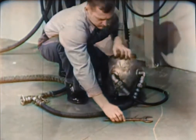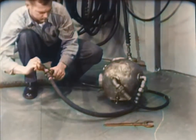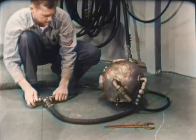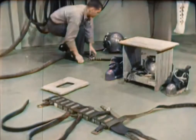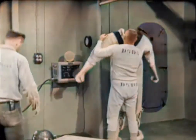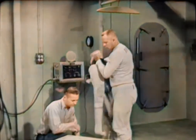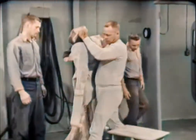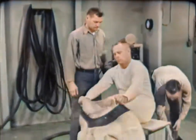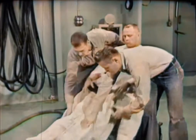Check the air supply by opening the air control valve — you'll be able to hear the air rushing into the helmet. Dressing the diver is mainly the work of two men, the diving tenders. They are supervised by the diving officer or the diver in charge, and assisted where possible by the diver himself. The diver is prepared for diving by donning one or two sets of diver's underwear, his choice determined by the temperature of the water and the amount of physical activity required by the job.